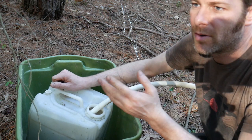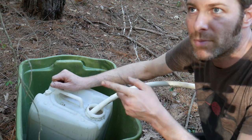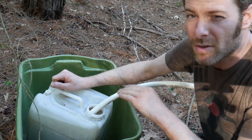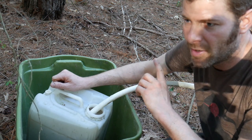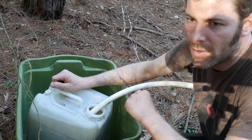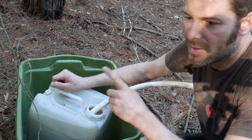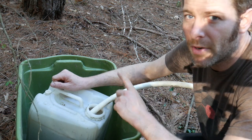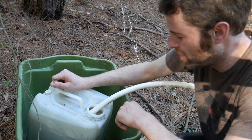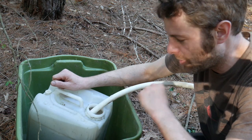And this time the Drummond 1 horsepower pump, it usually triggers at 50 PSI, that's when it shuts off automatically, and ideally it runs at 23. But this time it stayed consistently in between 25 and 30, which is a good number to be at. So it's not taxing the system. I actually had to shut it off this time around.